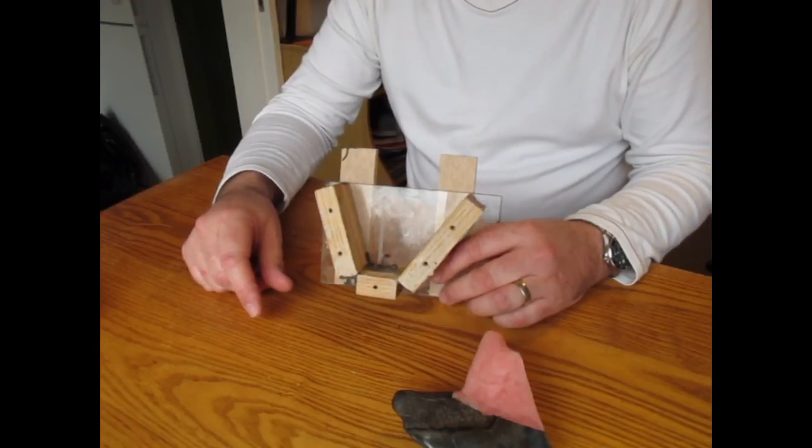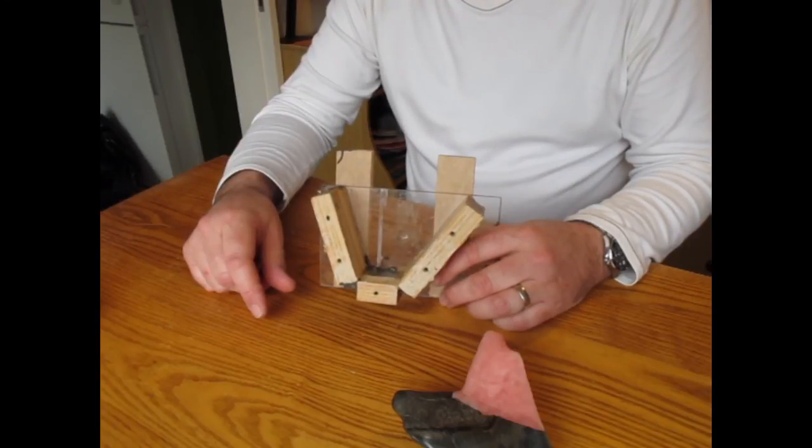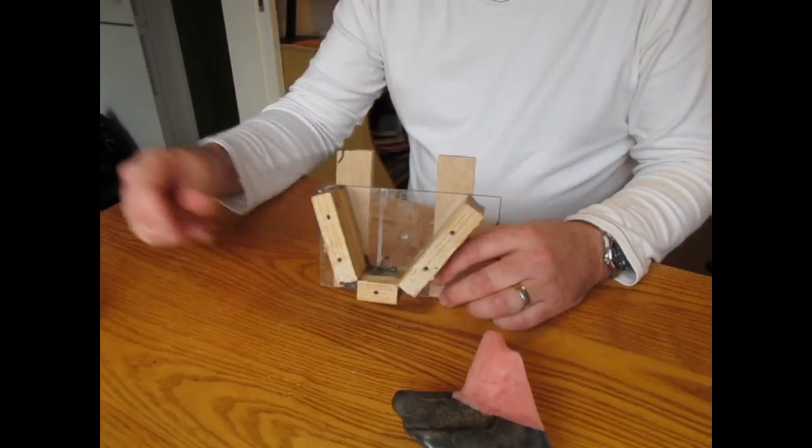The silicone I use is a condensation cured silicone. It's about the best value silicone you can buy. It's very runny, it degasses itself quite nicely, and it produces a really good mould. It's got a good working time.